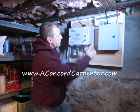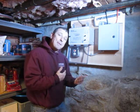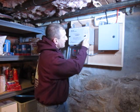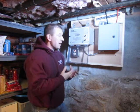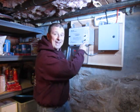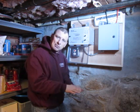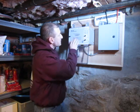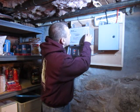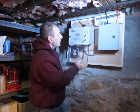The system can be turned on by hitting the start button, but with the switch on and the sensor active, it'll turn on automatically whenever there's snow or freezing rain on the sensor. There's also a hold-on time setting — Warmly Yours typically recommends three or four hours. When the snow clears off the sensor outside, the system stays on an additional three or four hours to continue clearing the walkway and dry it, so you don't get black ice. The high temperature limit is for the slab sensor — it won't allow the slab to exceed a set temperature. I have it set at 40 degrees; we really just need to melt snow at 32 degrees.